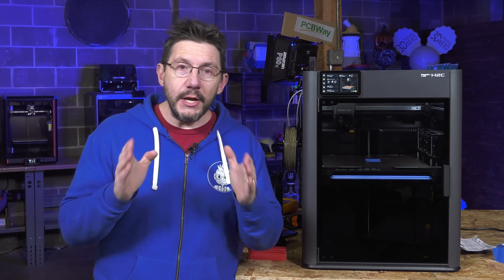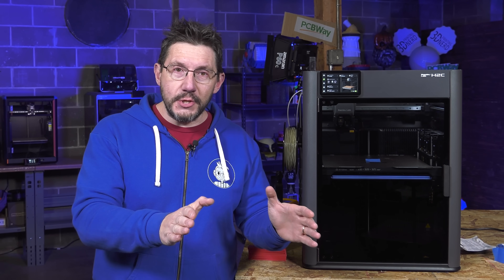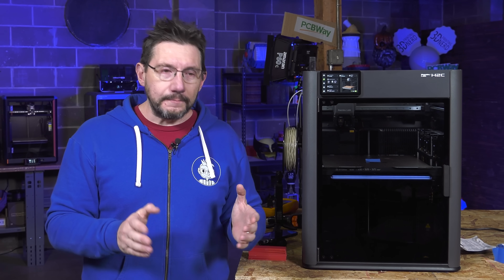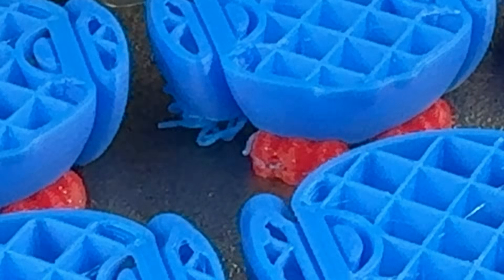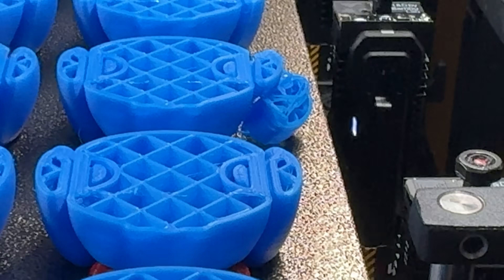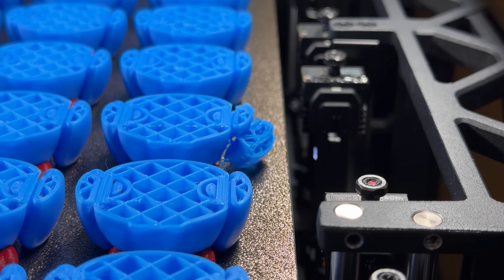I figured I should probably try the eagles on the old plate. So I took the old plate, washed it with Dawn dish soap and hot water, making sure not to touch any surfaces after drying it with a paper towel. I put it in the machine, hit go, and two of the eagles broke free. I couldn't have scripted this — two of the eagles' wings and feet had broken free. This was the old plate prepped the same way as the new plate, so all I can assume is that I had some sort of defective textured PEI plate that isn't holding PLA like it should.